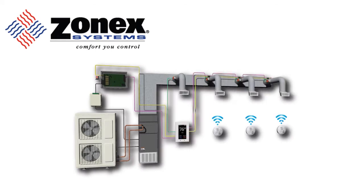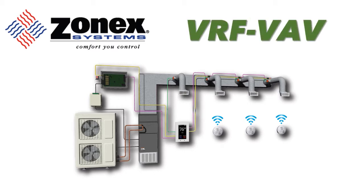Zonex has developed a new concept in air delivery for VRF systems. Now you can effectively and easily add zoning to VRF systems with multi-position air handlers and ducted mini-splits with Zonex's VRF-VAV offering. Again, you can use a single multi-position fan coil to serve multiple zones.